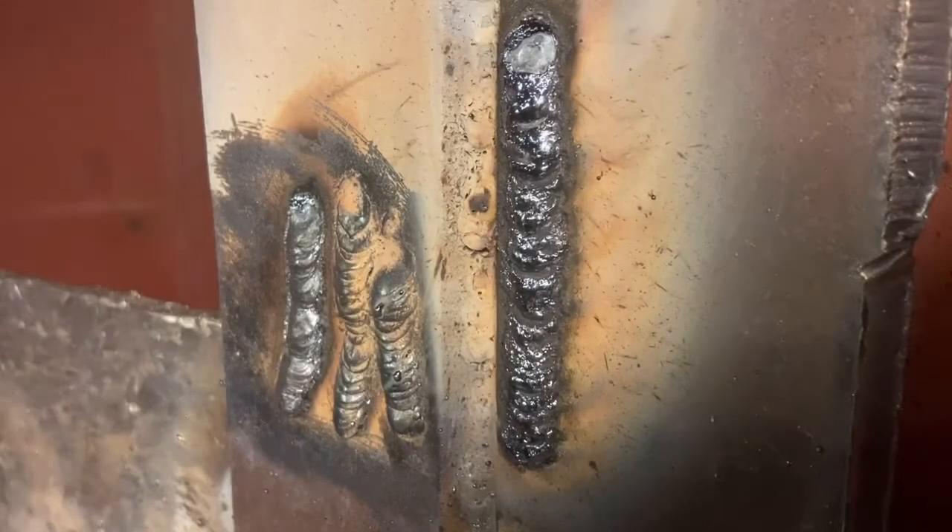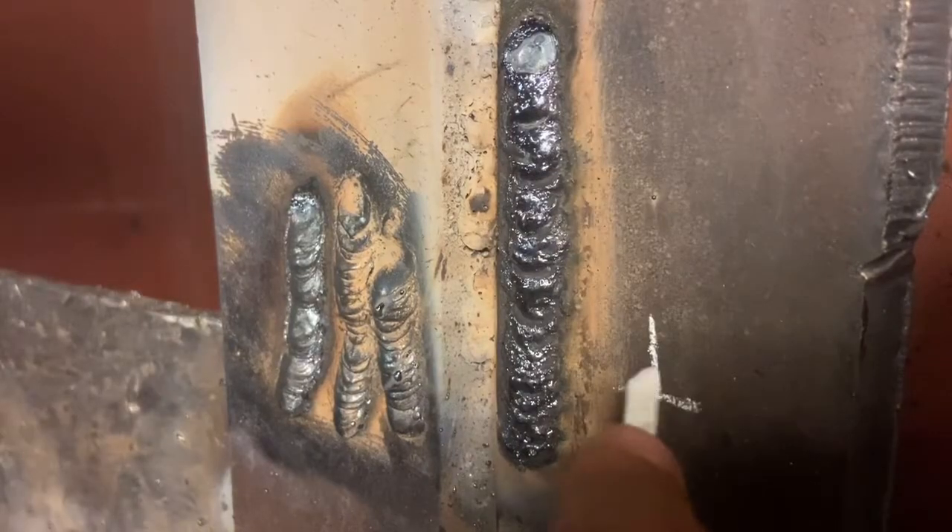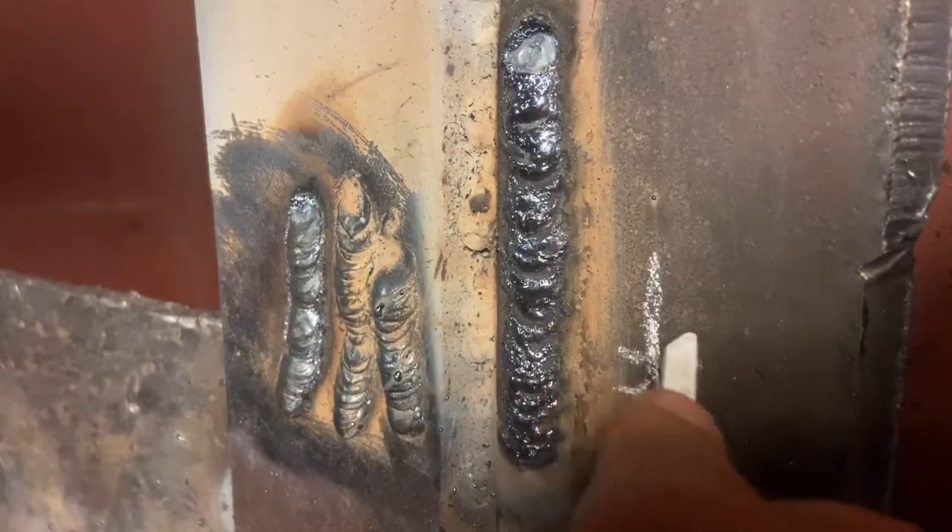Now for that beautiful upside down capital T: whip up, come down, side to side motion, pause at the middle, slightly whip up, come down and repeat the side to side motion, pause at the center slightly, whip up. And this is what it looks like — you're going to have to wait till the end till I wire wheel it, but this is the upside down T explained.